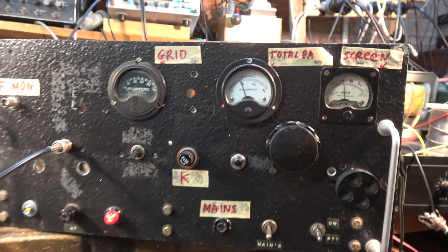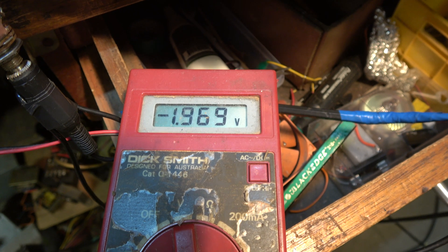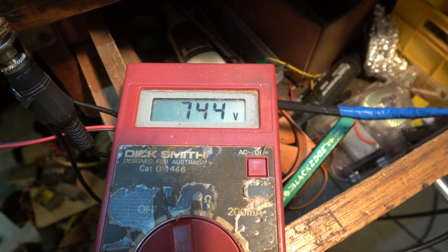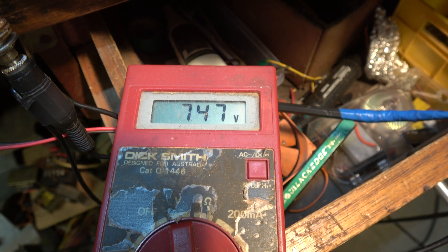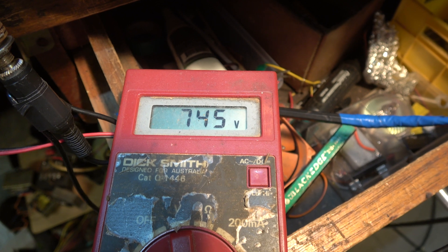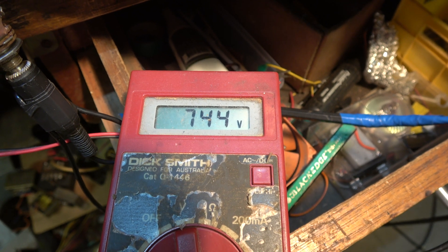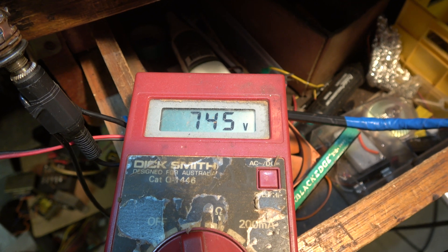You can get more out of them at low voltage if you push the screen, but I don't know if that's advisable. With the high tension on, it's taking about 750 volts — which is not nice, you wouldn't want to get across it — but it's not as bad as 1600 or 2000 volts. People often run 807s at 700 volts, and I don't think the 813 will be too worried since its maximum rating is two and a half thousand volts.